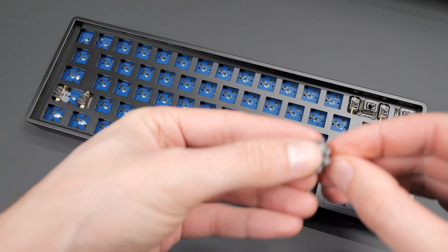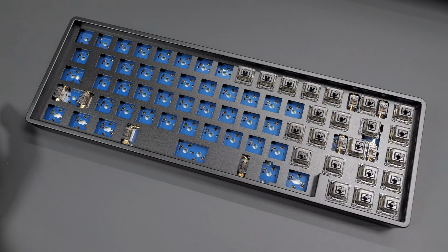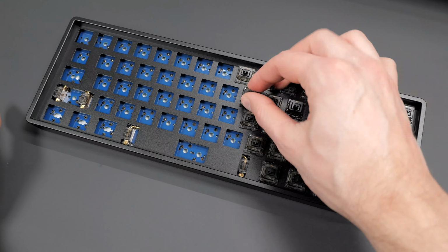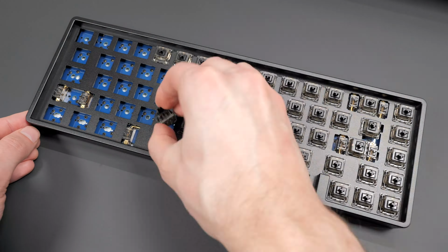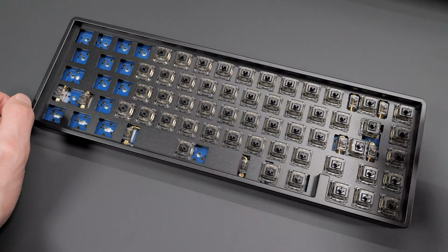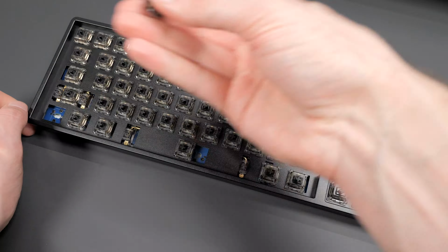Here, this PCB supports multiple layouts, so generally switch sockets are south facing, but in certain cases they are north facing or even east or west. Just something to remember when picking keycaps to prevent interference. Also, it doesn't have LEDs, so the switch orientation doesn't matter much.